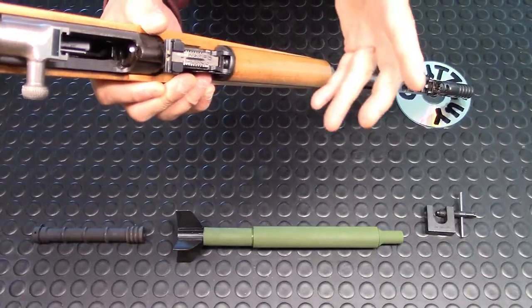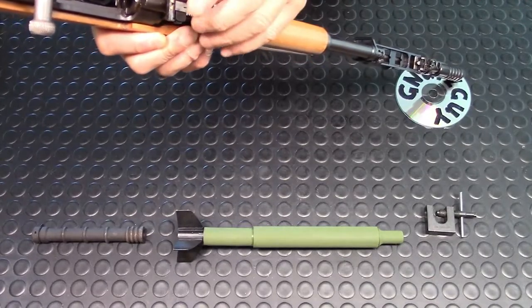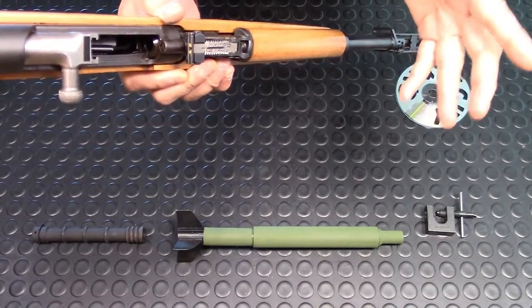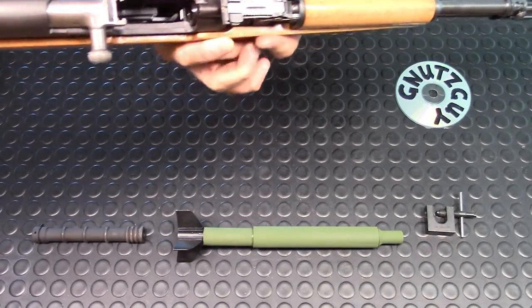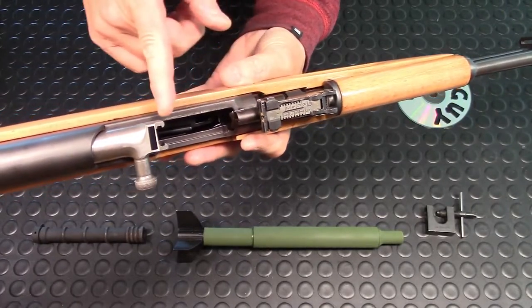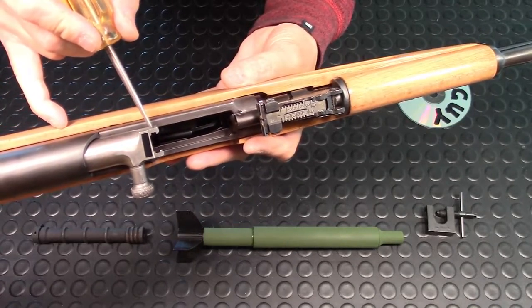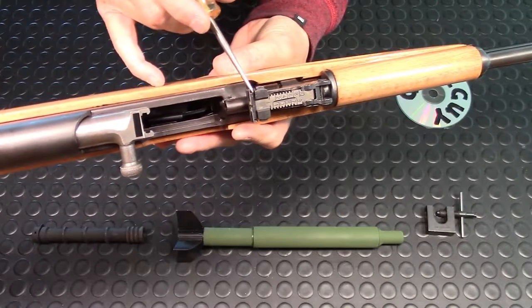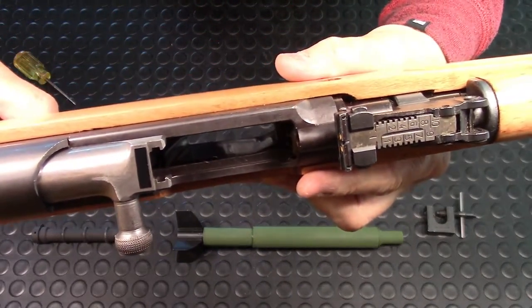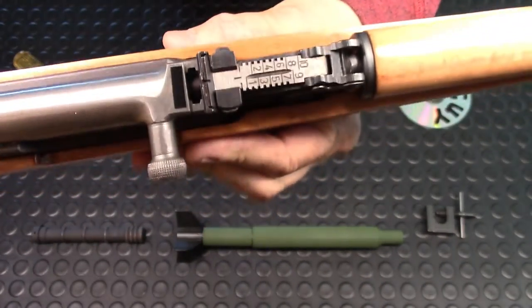They also do come with tritium tubes. Although I've never seen one, if you go to John Yoper's SKS site you'll find a picture of what they look like — so they do come in both phosphorus and tritium. Also, because they attached this night sight, they had to mill out part of the front of the carrier — about two millimeters deep and eight millimeters across — to clear the night sight, otherwise it would bang into it. That's the milling they've done; if they didn't mill it, they would collide.